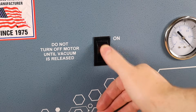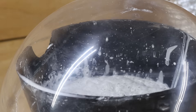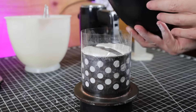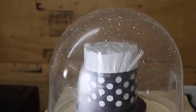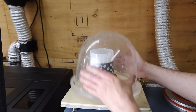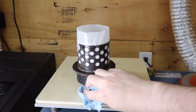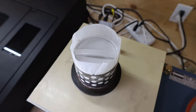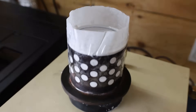This entire mixing process adds a lot of air bubbles, so we need to vacuum it to remove as many as possible. This is where my vacuum casting setup comes in — I just turn it on, put my bowl under the dome, and start vacuuming out all the bubbles. It's going to look like the investment is boiling, and it'll sit there for about a minute. Once that's done, you can pour it directly into your flask, then put the flask back under the vacuum dome for about 2 minutes to get out all remaining bubbles. You can see right here why I add so much extra tape, because it would overflow everywhere. With that done, remove the dome and clean up any mess while it's still wet. Now you need to let this set up and harden — don't move it while it's doing this, and it's going to take 2–3 hours.